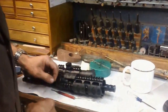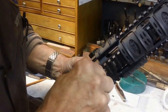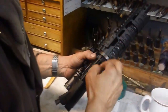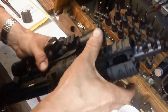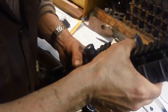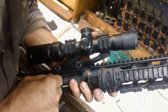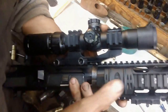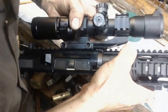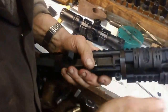Get the Allen wrench. In one of these right here we've got a little Allen head lock screw which holds the forearm on there — just break that loose. They're usually not real tight. In this case we'd better remove the scope. You want to make sure you haven't got anything that's going to stand in the way. The way it saddles on top of that Picatinny rail, it wouldn't have unscrewed. So we'll remove that so it won't let it twist off. Make sure everything's clear off your rail.